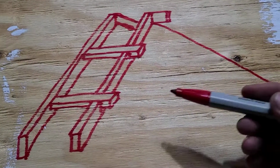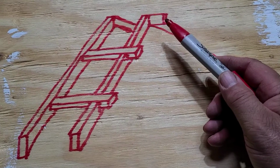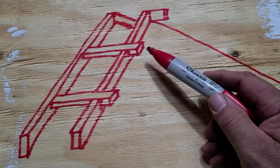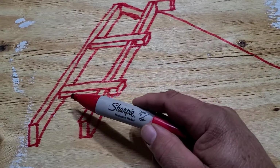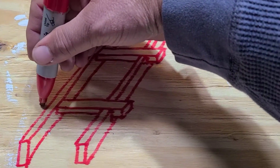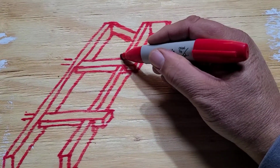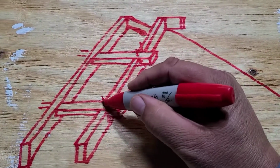All right, hopefully this picture better illustrates what I was talking about. You have your peak block up here, sticks out a foot. You have your outriggers spaced out a foot from the edge of your gable truss, cut through the gable truss. And then they go back and tie into your first regular truss. You would screw those in from the back side, obviously, with a couple screws through the truss. And then these would be screwed down through the top of that truss.